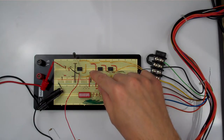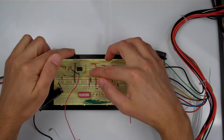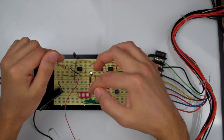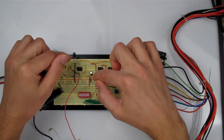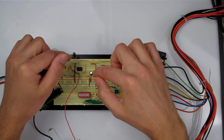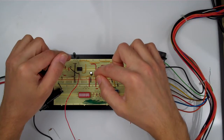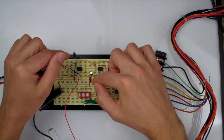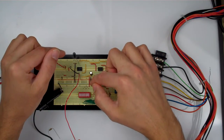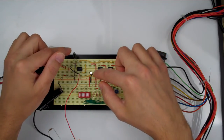When I put in a couple of 10 microfarad electrolytic capacitors right here - from the 12 volts to ground and from the negative 12 volts to ground - watch your polarity on these. We might typically be used to putting the negative side of the electrolytic capacitor to ground, which you do for the 12 volts side. But for the negative 12 volts side, the negative side goes on the negative 12 volts terminal instead of to ground, because it's at a lower voltage potential than ground.